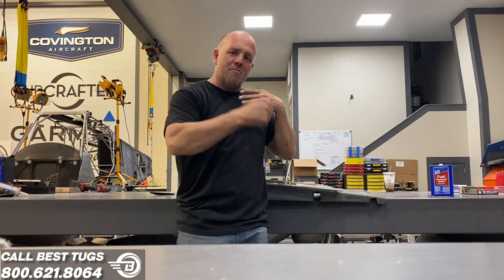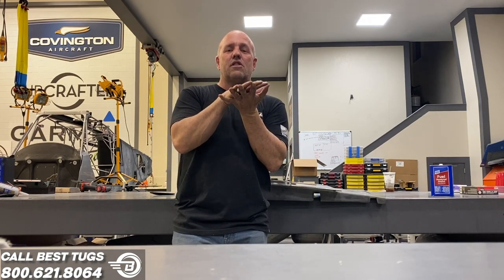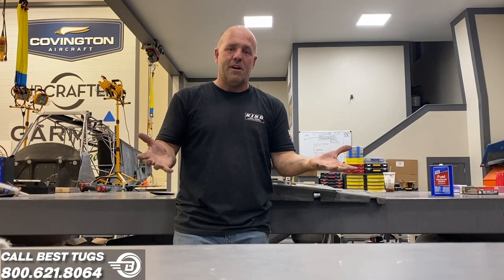And so you want to warm both sides so that as the acrylic expands from the extra heat, you get it to expand evenly. So I guess the trick is, really, I should have had two people on it and had two guns going. I was just barely able to keep up with the heat. It kept cooling as I went. If I had more even heat, or my old vacuum oven, it would have been great.